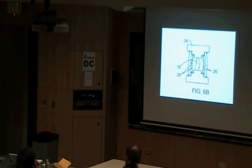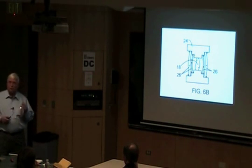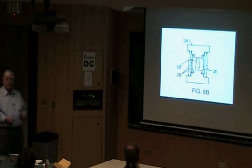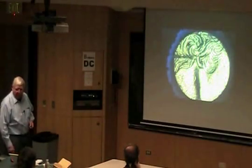Now, there are various things you want to do. If you're not putting lenses around it, you may want to coat it with something to keep humidity away from it, because these are materials that can dissolve a little bit. And you can do that. You can spin coat it with something like dissolved polyvinylidene chloride. You can use a gaseous coating technique, coat it with something called parylene, or you can grab some saran wrap from your kitchen, which is polyethylene, put a little bit in front and back and grip it in the cell with that. Any way you do it, you can seal it up so that moisture can't get to it anymore. So the question of moisture is really minimal.